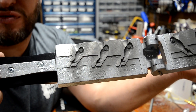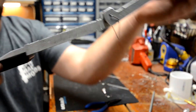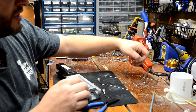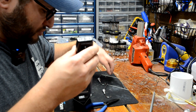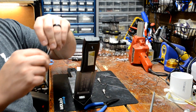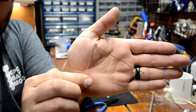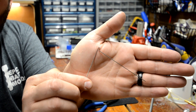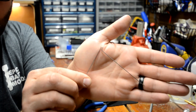I don't really get too much call for quarter ounce. I can make them, but they're a smaller wire size. This mold takes two different wire sizes. The wire size we're going to be using today is a .040 wire size. You can get these wire forms from Do-It Molds or Barlow's — I get most of my stuff from Barlow's Tackle.